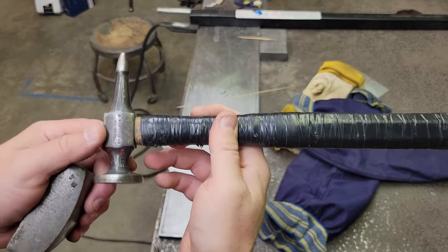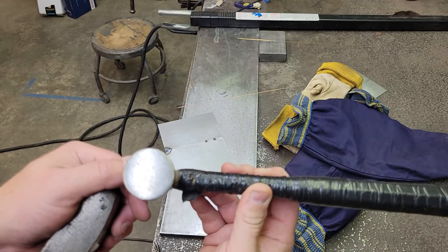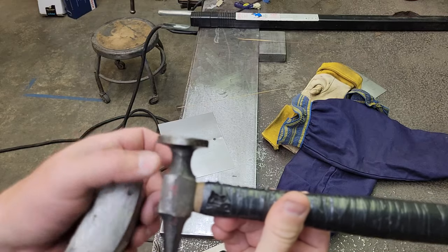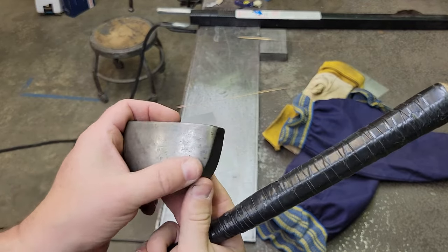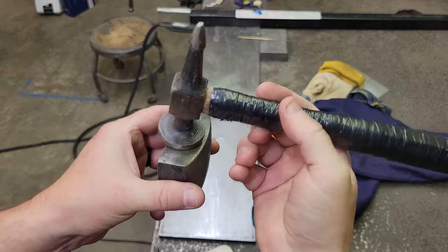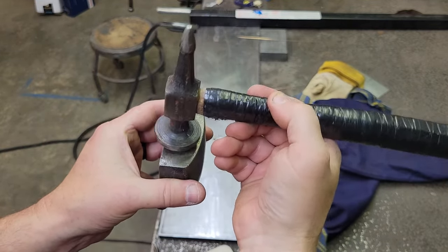The hammer I'm using today is my old trusty. It's taped together. I love it. It's an old Snap-on. I don't know how old it is. It has very little crown. It's almost dead flat. And I'm going to use this old cheap kit that you get at swap meets and stuff. I need to block these and make them nice, but I'm gonna use this flat side here, and we're just gonna do the hammer on technique. We're gonna just tap it till you hear that tinging.